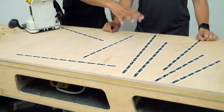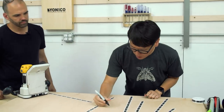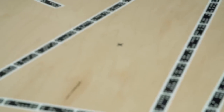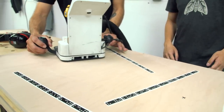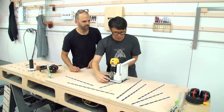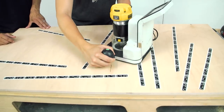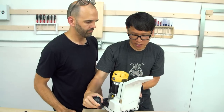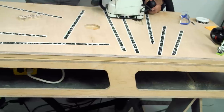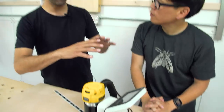So I've got an arrangement of the markers down. Is this good enough for the scan? It's good enough for the scan — this would enable you to cut some stuff in this area. Let me draw an X marks the spot right there. Let's go through the scanning process. I just hit scan here. The camera immediately shows that trapezoid view and highlights the dominoes I'm seeing. I'm just moving it around now and it's drawing a map. What happens if I lift the Shaper Origin off the platform? You can actually do that — you can just take in the information. It's creating, filling out the map of the area as long as it gets those tracking markers. I'll finish with the green button.